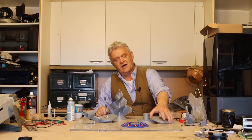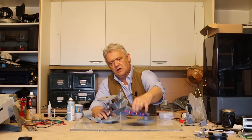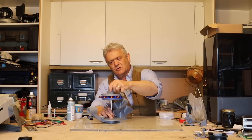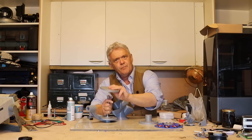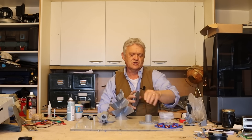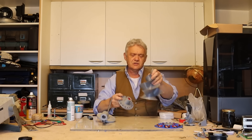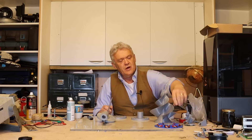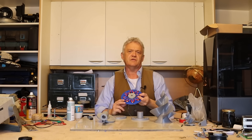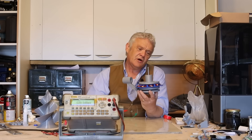To put them together: we've got an eight millimeter bar, we put the magnets in, then slot them together. The coil slots on top like that, and when we put the magnets in the second disc, that slots on top as well. These two - the top and the bottom - will lock together because of the magnetic attraction, forming a magnetic field. Then we put our cone on top. All I've got to do now is put the magnets in north-south-north-south and wind the serpentine coil.